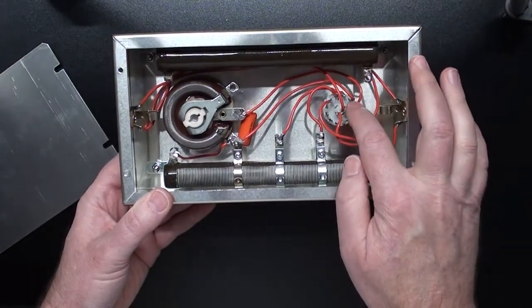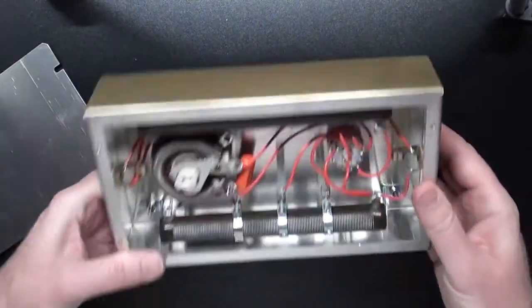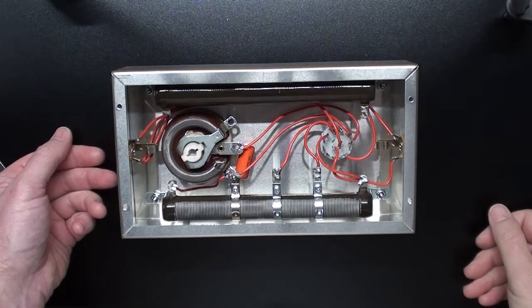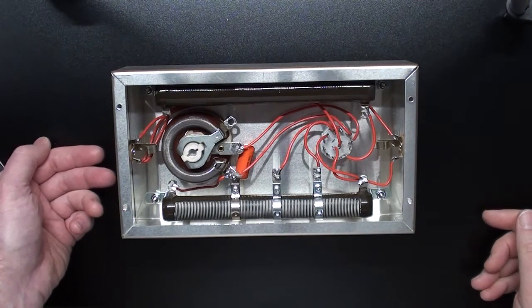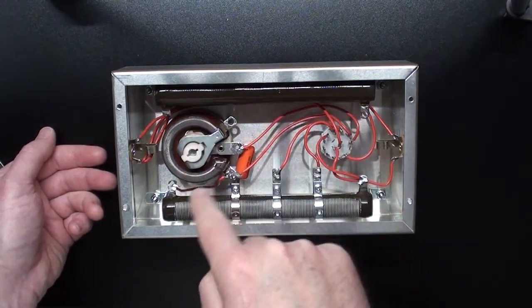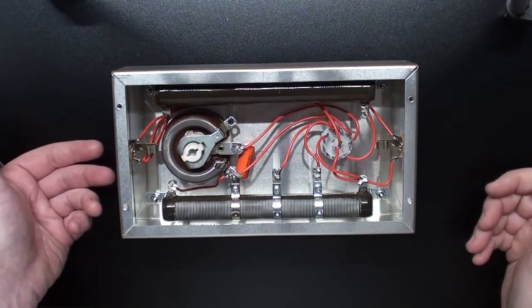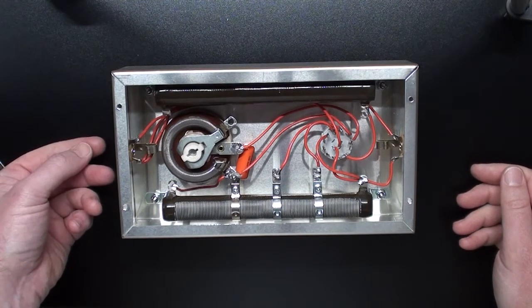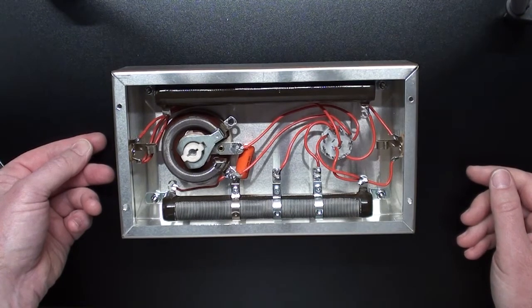This is the six position switch that allows the differing levels of attenuation. Most passive attenuators work by changing the level of energy that goes to the speaker into heat. That's why these resistors have to be such high power ratings — because they take up to 100 watts of energy going from the amp into the speaker and turn it into heat as they reduce the level.